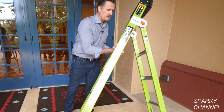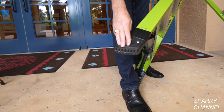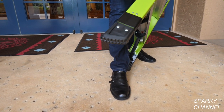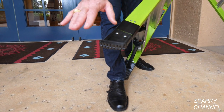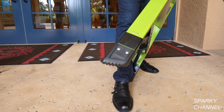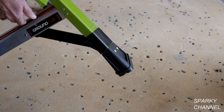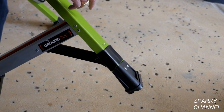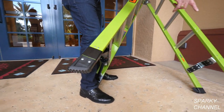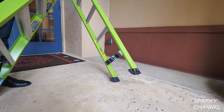One other thing at the bottom of this ladder — if we look at the feet, you'll notice you've got nice big industrial feet on this product. They're also not riveted in. Like tires on your car, eventually they'll wear out. You can take out these two screws, that foot will drop off, and you put it right back on with two more screws — field replaceable very, very easily. There's also a rail shield integrated into the bracing, which helps protect the bottom of the ladder. Fiberglass ladders often get a lot of abuse getting dragged in and out of trucks, so this helps to protect it. The same on the back side — those feet are field replaceable in a matter of seconds.